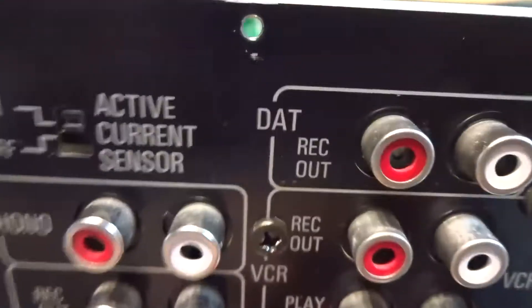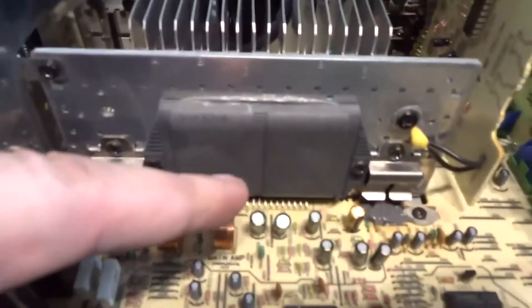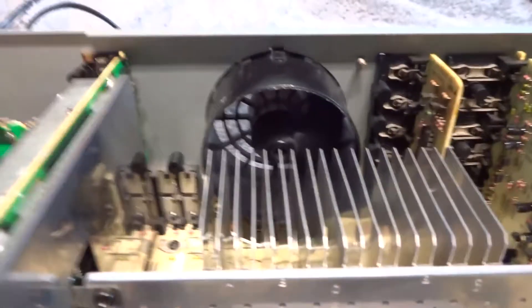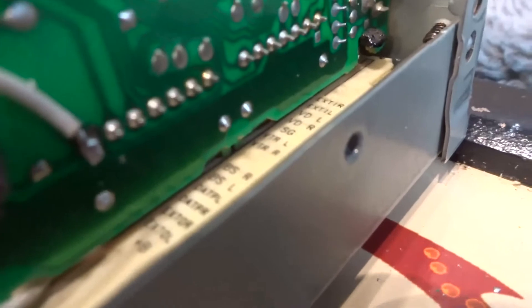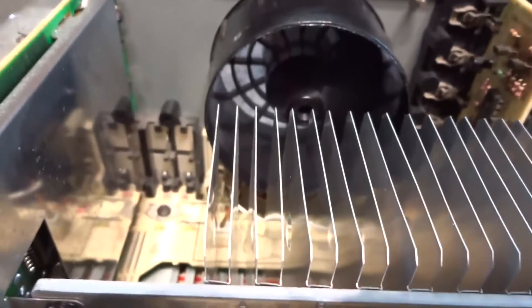If it's just a cracked solder joint, which more than likely it will be, it's not any particular fault with this amp — just that little problem. And I've got to strip all the board down to sort it. These get hot — I'm not joking, these get hot. And for the sake of blowing the SVI chip down there, which they're 70 quid to replace, I've put the fan on permanently as you can see. It's on silent — it's not loud. As long as it's got air pulling out the back, we're all good and this stays really cool. What I've done is soldered it onto the last terminal on that output there — 12 volt — and put a resistor on it and knocked it down to about 6 volts. It's really quiet so you don't hear it when it's on.